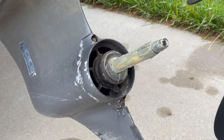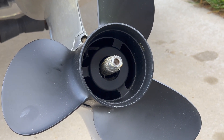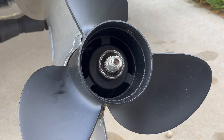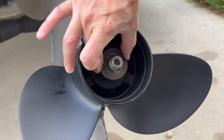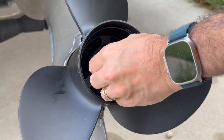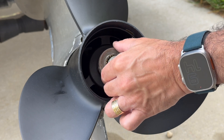Here it goes — that's how it goes. Come from here, and there you have it. Then this thrust washer goes here. I'm going to add some grease as well on this part right here, because this is going to be metal touching metal. I want to have a good amount of grease in here.